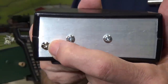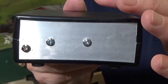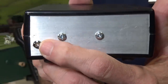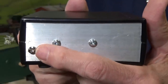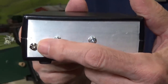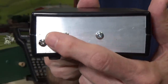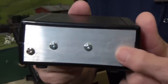There's a little screw provided as a ground contact. If you have two devices — say an SB5 and a DB5 hooked up together for 10 amps — you need to run a plain copper wire between them attached at this screw, to daisy-chain the ground connection. However, never attach this to your household wiring or household ground. NCE uses what they call a floating ground — all devices are grounded using a common wire connecting them, but they are not connected to an earth ground.